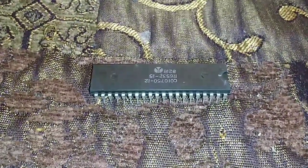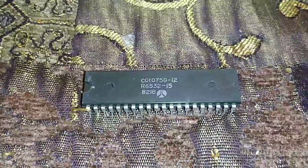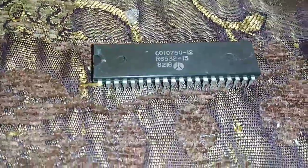This is the new RIOT chip — these things are semi-readily available on eBay. This is a used one but claimed to be working. You'll notice the print faces this way, but it installs the other way. See the notch on the left — you want that to be on the right-hand side when you install it.